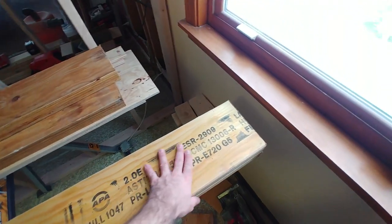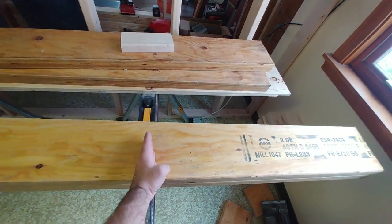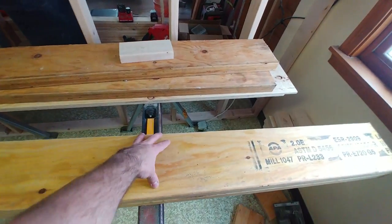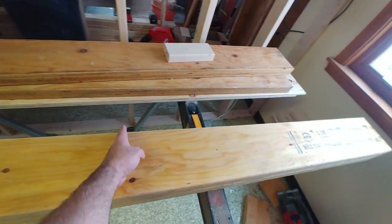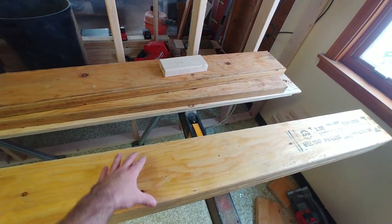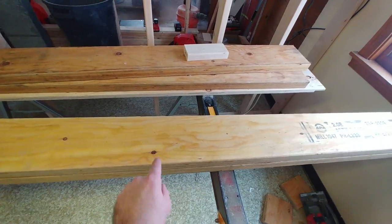How do we do it correctly? You want to go in intervals of 16 inches, every 16 inches, like your wall spacing. And ideally, you want that location every 16 inches to work out stacked up right on your wall framing. It's going to be a vertical line of nails for fasteners. This is a two by eight nominally, so we're going to go four times. If it was two by six, we'd go three times. If it was two by four, we'd go twice. If it was two by twelve, we'd do six times.